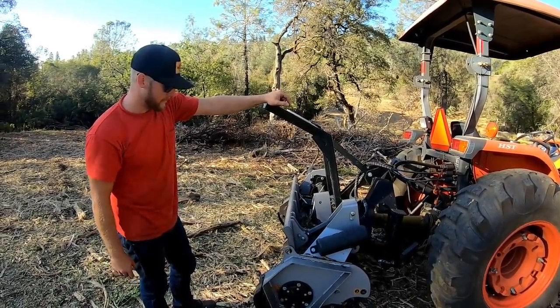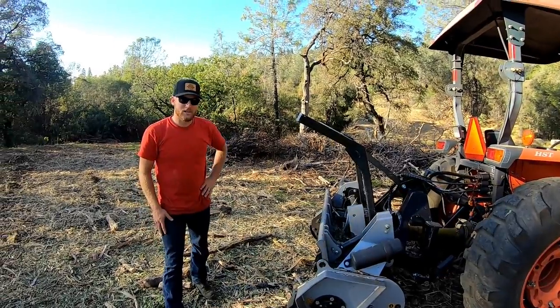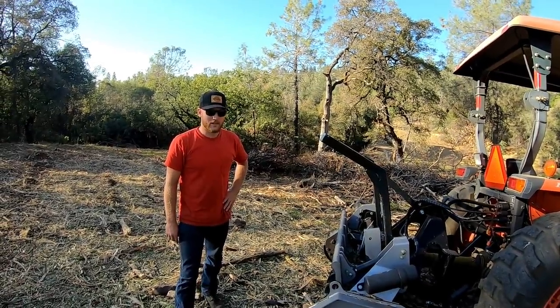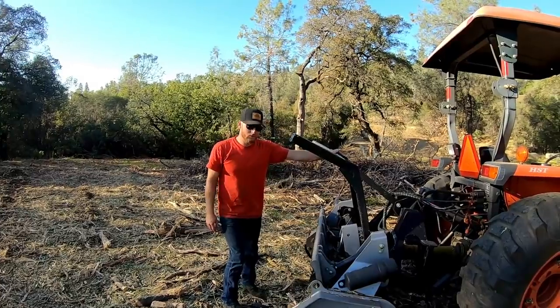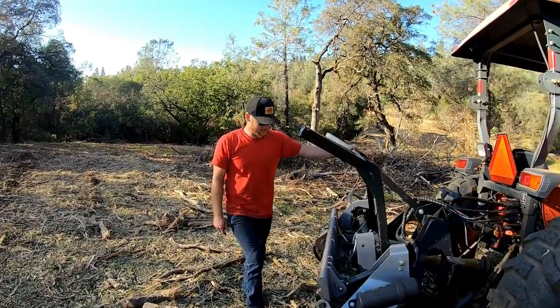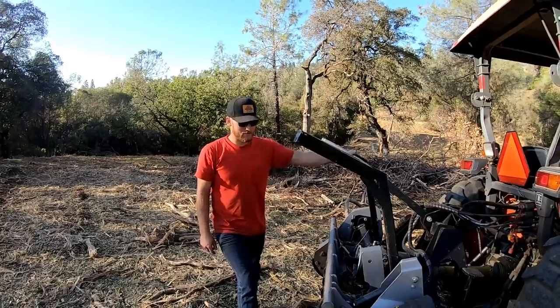I only ran it for 15 minutes, but you know, high RPM and max potential every time it runs into something, and how fast it can spool back up is pretty nice given that it's PTO, it's not waiting for hydraulic flow and all the restriction of the hoses. So there's goods and bads about it. I did clog the head up and it took a couple minutes to unclog that, so that wasn't too much fun.